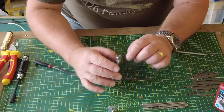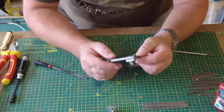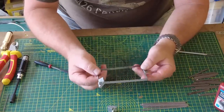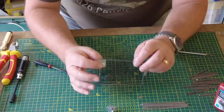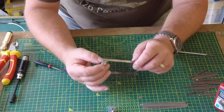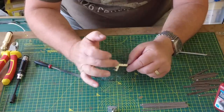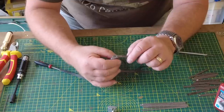All right, so I'm back on camera now after having to swear at this a lot. It's the most fiddly, tedious, annoying part of the build so far. So this is the problem I've got here, right? You've got this hinge, and that's going to take a lot of stress, and yet it's pivoting like this. To me, it should have had two fixings, but that aside, it is what it is. And you can see, even though I've countersunk the hole even more, this is still sitting proud. So this is going to have to be ground down on my bench.